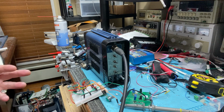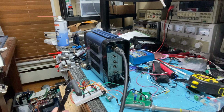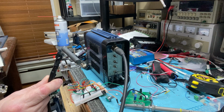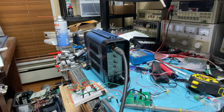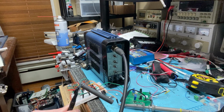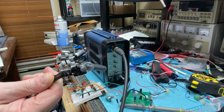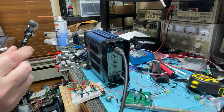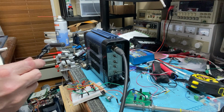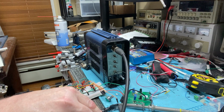the magnetics. But like I say, it needs to be in a metal box. It needs to be screened properly. You don't want temperature fluctuations on these. That should more likely go in a little bit of PVC tubing, so there's no circulating air currents getting around it. Bit protected so you don't get fast air movements. I've got it sealed there at the moment. It's sealed up in hot melt glue, and I just stuck everything together like that. It shouldn't move around very much, but as you can see, because this is all open structure, it's picking up a lot of noise off the equipment on the bench.